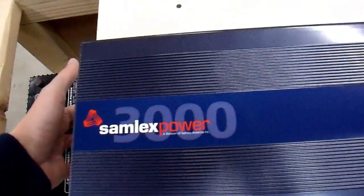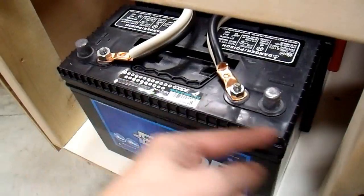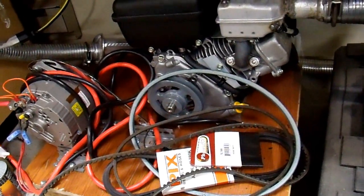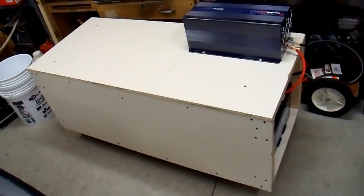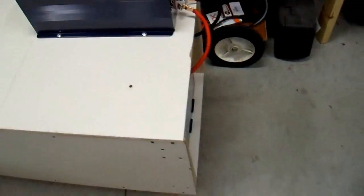In terms of where I'm going to hook it up, I think I'm going to put it on this second battery back here, and that will free up the terminals on the first battery for connecting up chargers easily. Also, these terminals become a lot more available for my generator assembly that I built and made a video about, so I can very easily hook that up to recharge it if I need to in an extended power outage. And there is the completed battery bank and inverter assembly — pretty well enclosed except for the ends for ventilation, keeping the cabling safe.